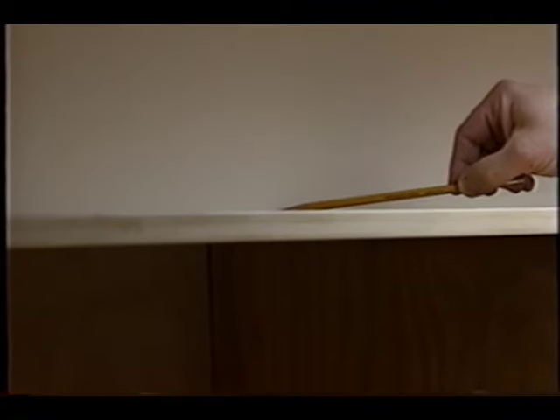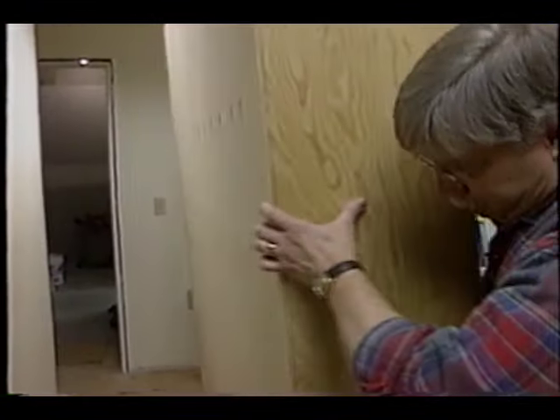How do you do it? Go ahead and draw a little thin pencil line where the bookcase touches the wall — I'm talking about the top of the bookcase. This is your reference mark. Then move the bookcase out of the way.